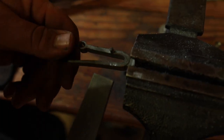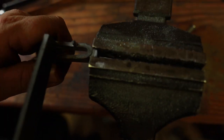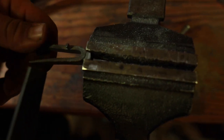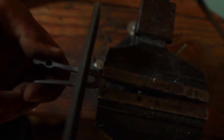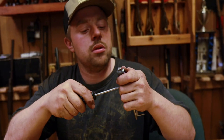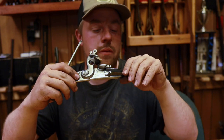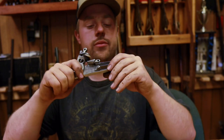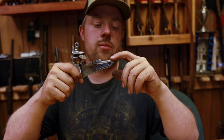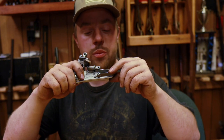I'm not clamping onto the spring itself — the spring has not been treated yet so it's not at the right temper — that's why I left the gate on the casting, so I can clamp hard onto that. We're just going to trim this down a little bit. There you go — it's pretty well fit in there. I've got a little more finishing up to do, but man that's going to look pretty sharp. Next we're going to finish fitting it perfectly, then get rid of this gate.